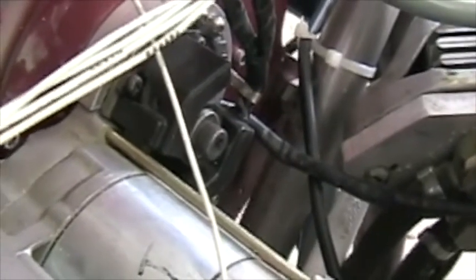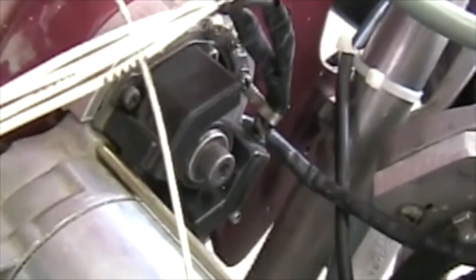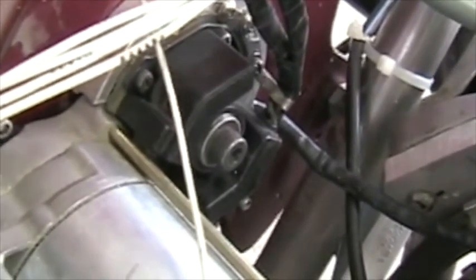I'm running a non-standard second ignition. I've taken the AeroV system off and I've replaced it with a Honda motorcycle unit, which has a retard system to allow me to hand prop easily for starting. There are the coils and the two amplifiers mounted on the firewall.